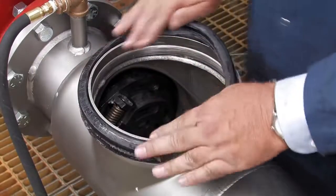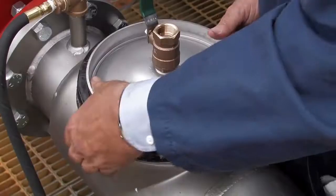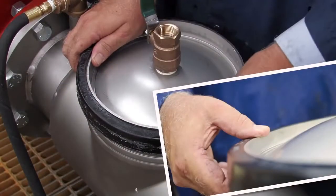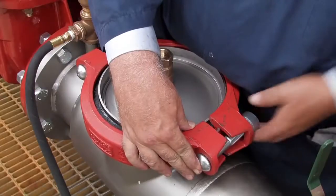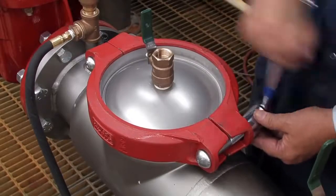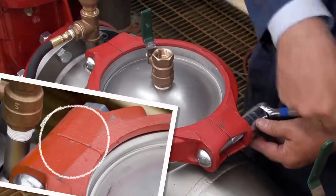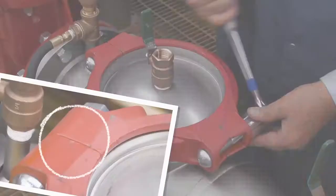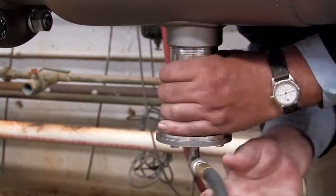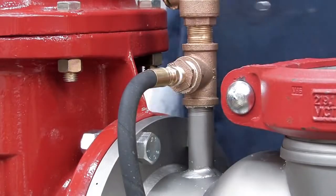Place the rubber gasket around the valve access port. Reinstall the lid and carefully move the gasket into place, flush with the edge of the lid. The coupler should be reinstalled around the gasket and lid, tightening the bolts evenly with a socket wrench until the coupler makes pad to pad contact. With the gasket reinstalled, re-thread the relief valve hand tight. Reconnect the sensing line with a wrench to finish reassembling the unit.